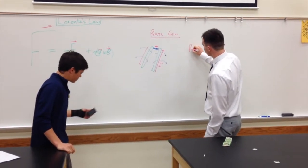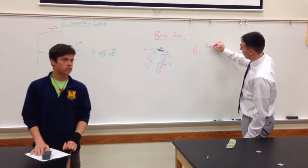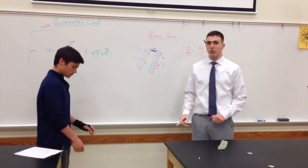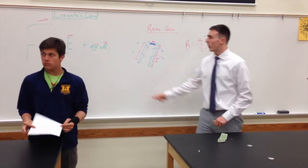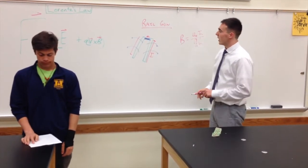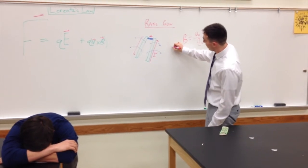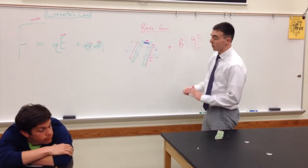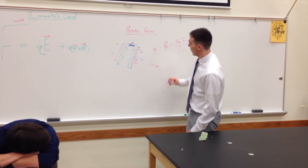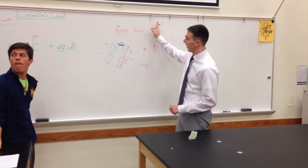You know that a magnetic field for a simple loop is the constant of permeability of free space times the current over 2R, and thus we also know that an electric field is created. So assuming those two, Lorentz's law is then applicable. What that means is our projectile — this blue line — is propelled by the magnetic field and electric field. If you draw it out, you have the current in this direction, the magnetic field coming around using our right-hand rule with the current going this way. Picture that in 3D space, and then our force is going to be a cross product of those two, which propels the projectile this way.